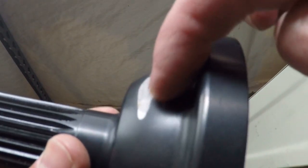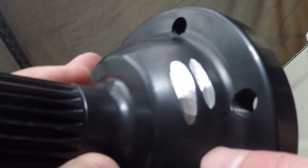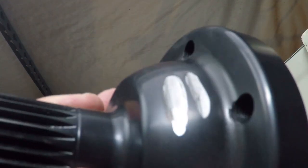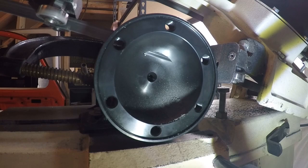I'm getting ready to cut this piece — the micro stub — right around here. The first thing I did is I jigged it up in the bandsaw and touched it with the blade right where it's going to cut. From experience I know that trying to cut on this radius surface, no matter how slowly I introduced the blade, it would have drifted. So I let the blade nick it so I knew where it was going to cut, then I gouged a portion of it out with my grinder so the blade will sit in there and won't be starting on the radius surface.